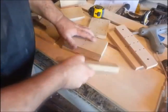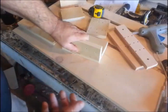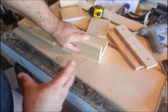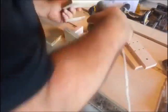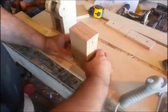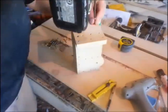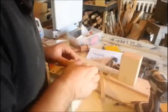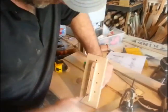Because I'm doing this for tutorial purposes and I'll probably use it a few times and then take it apart, I'm just going to use hot glue to do this quickly. I glued the whole assembly together before putting any screws in — that way if there are any mess-ups I can find them, pull it apart and fix them. I lined everything up, put hot glue on it to hold it in place, then ran bolts and screws in to secure everything up. Then I put some three-quarter inch tracks on the bottom to ride in the slot, which lines everything up.